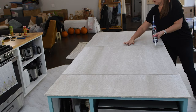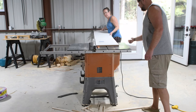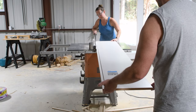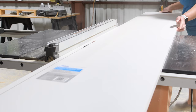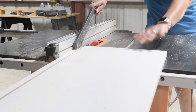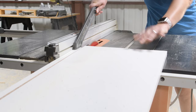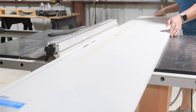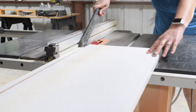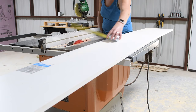Once the silicone was ready it was time to add the sides of the forms. The sides are made from melamine-coated board — actually a shelf, a 96-inch by just-shy-of-16-inch piece from the shelving section at my local big box store. I used a table saw to rip down strips to the size I needed. The first strip is placed underneath the overhang of the back hardy backer board, set to the exact overhang dimension I want on my finished countertop.